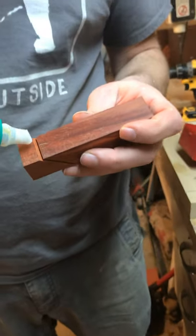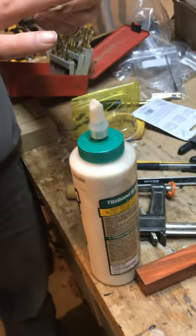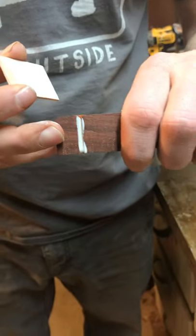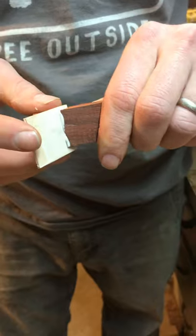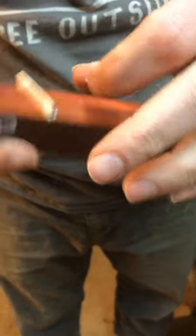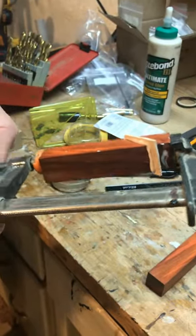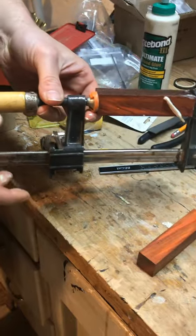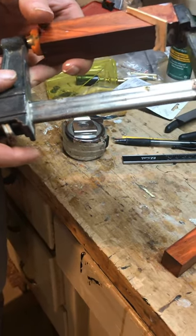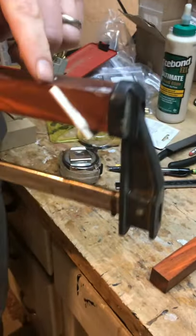So now we're going to glue our infill of wood into the blank. It helps to use your hands to pry the kerf open a little bit so it can slide in a little bit easier. I'm prying that kerf open and making sure that it sets all the way in there. Then we'll clamp it up — that's the first step. When you clamp it, if you hear your blank starting to crack, that means your saw kerf is a little narrower than the piece of wood you're trying to put in there, and it's acting as a lever and it's going to snap your blank.